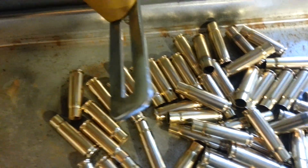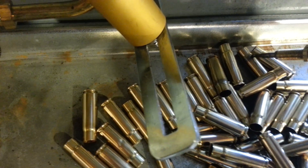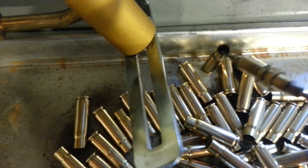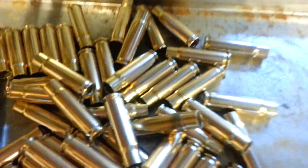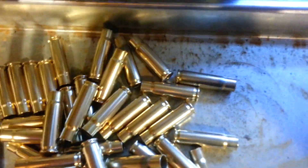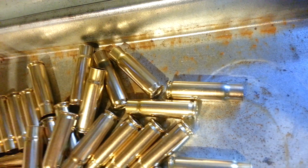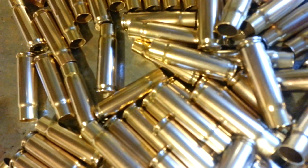You can see another one that I did earlier, kind of as a test — that would be this one right here — and this one that just dropped out. See the ones that dropped out immediately? So if you're going by color every time you anneal rather than temperature, you're not going to get consistent results. Because even though these ones don't show any coloration at all, they're all done correctly.